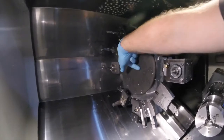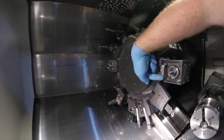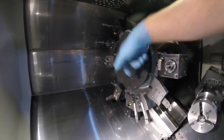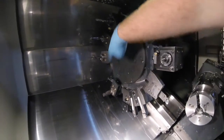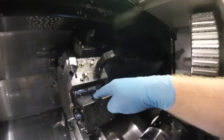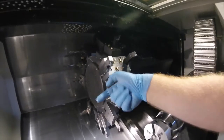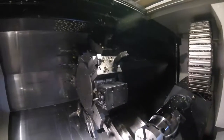Underneath this plate you have a bevel gearbox and the drive shaft then comes out from the motor in that direction to your tool holder. The drive comes through your driven tool and then turns another 90 degrees into another bevel gearbox to face forwards, or if it's a radial one it just comes straight out.